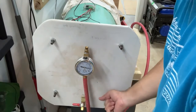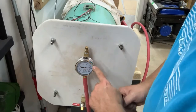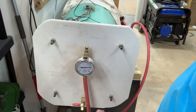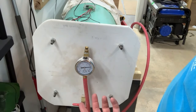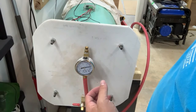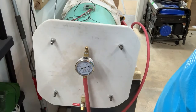I don't need it to be super tight because the vacuum will pull on it eventually, but it will leak if I don't tighten it a decent amount. So I'm already at 5 — perfect vacuum is 30. This is supposed to get to 29.5 or something like that, which is really really low. Occasionally I get there; usually I never get quite all the leaks out. It'll stay there for days. Usually I get about 28 or 29 even, and that's generally good enough.